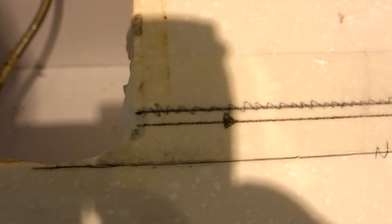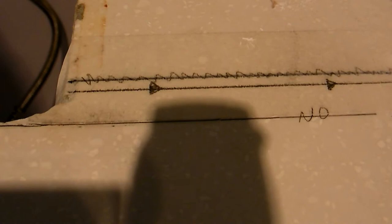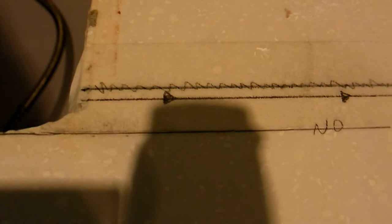What I ended up having to do is run a sight line off of that to get an idea of how deep off the original cut, which is now screwed out. I did a sight line off of this side too, which shows up over there, and I noticed that I should probably have about a quarter of an inch from the new sight line, which meant I needed to drift the cutout towards the front of the counter by about four or five millimeters.